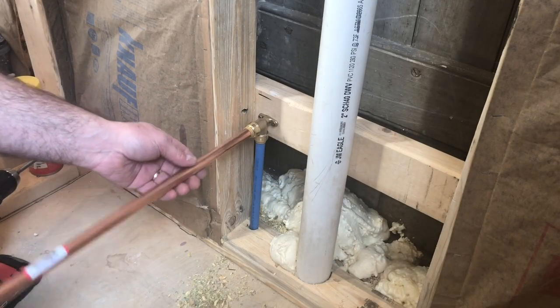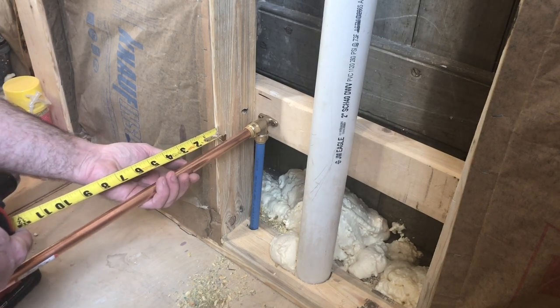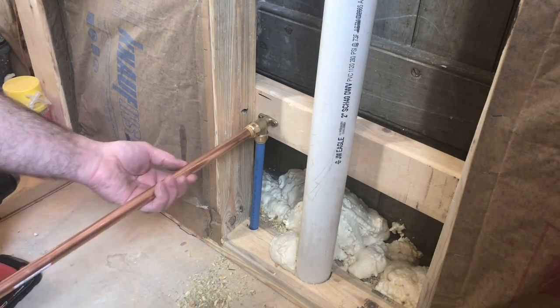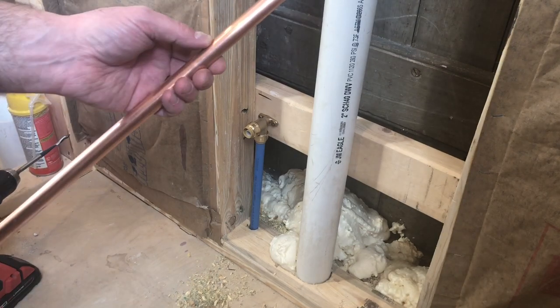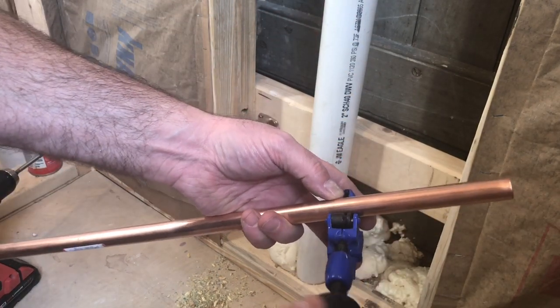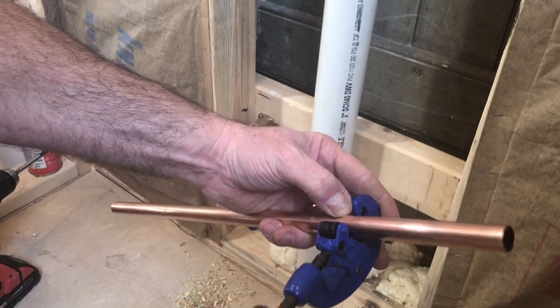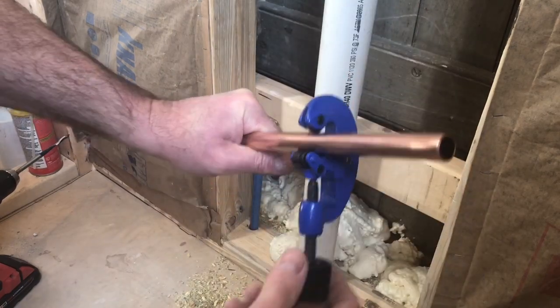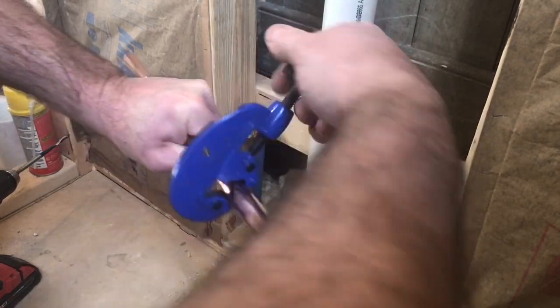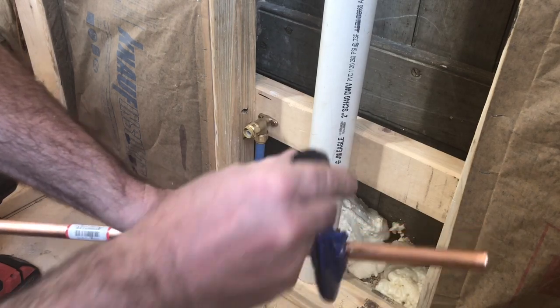The last thing I have to do is cut out a small section of half-inch copper pipe. I'll cut this at about three inches out from the stud wall, which will give me a good solid two and a half inches out from my finished drywall — plenty of room to attach a quarter-turn ball valve with a compression fitting that will be the on-off valve for my toilet water supply.